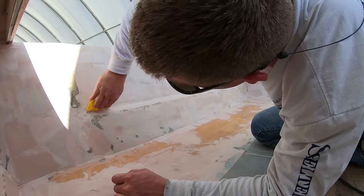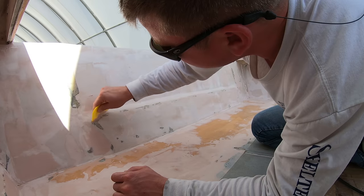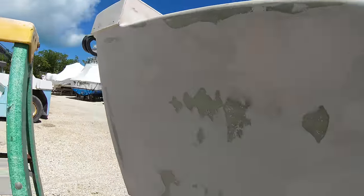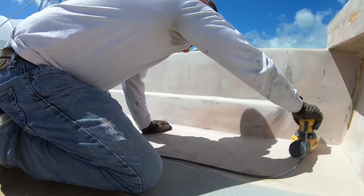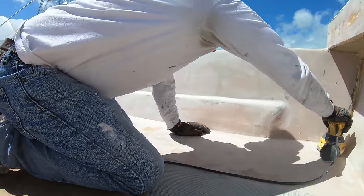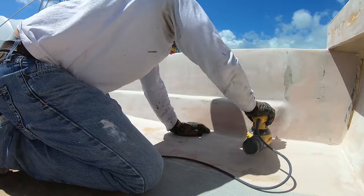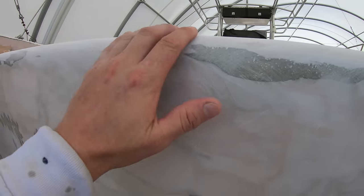We'll go around and fill in all the deep marks and spots with the plastic scraper, getting the surface as smooth as possible. It's best to stop using your eyes at this point and start feeling the surfaces so that you can feel whether it is lumpy or has any imperfections. It's also important to hold the sander flat against the surface and not use the edge of it, which creates more high and low spots. We'll want to fill in any lines or scratches left from our knives as well.